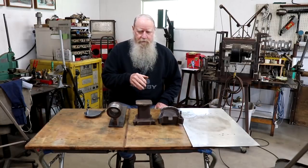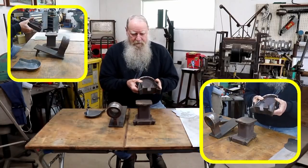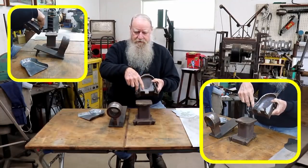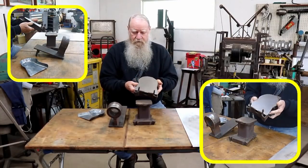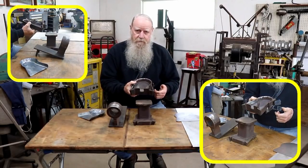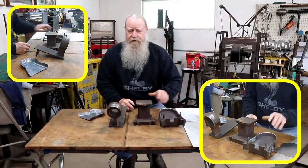There's going to be some questions, so I'm going to go through the dies first. This is the bottom die, made out of half inch thick material. The base of it is cut to the final size of the bottom. It has two guide pins here and one here, which is a stop for the blank to go in to fit in. This notch is for the tongs to place the hot part in. These other pieces here are just to maintain it on top of a spacer block that I have on top of the treadle hammer.